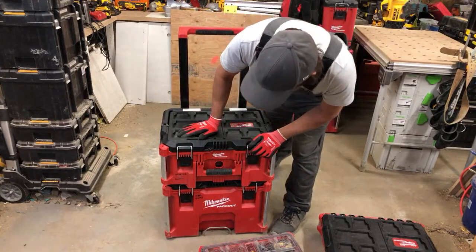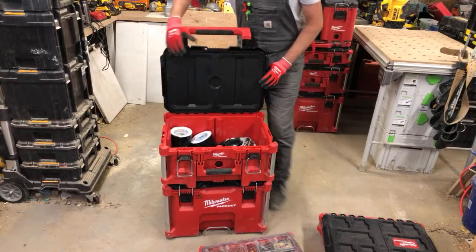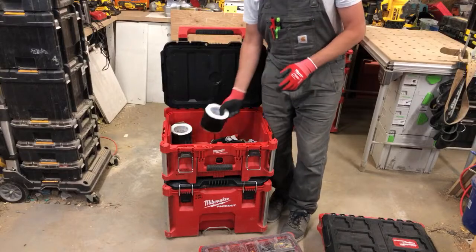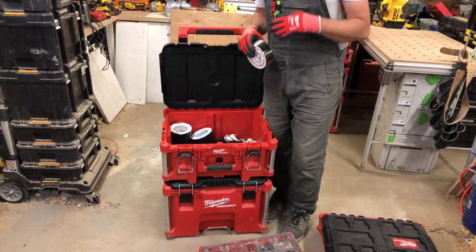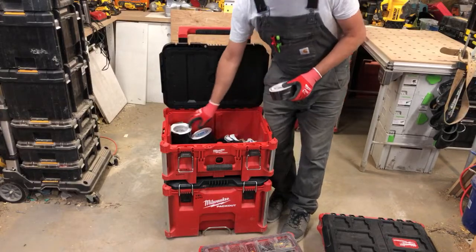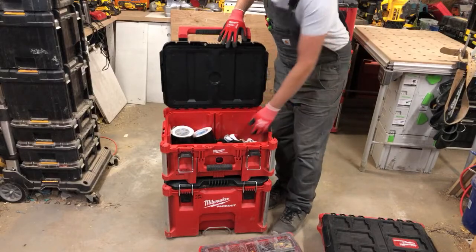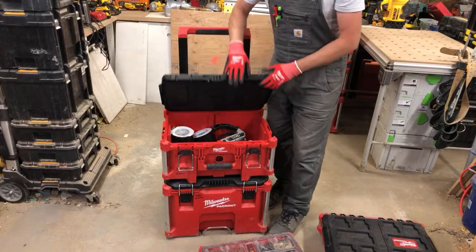The next box is my random box — this is where joist tape lives. We use G-tape on all our joists for our deck systems: four-inch, six-inch, and two-inch. This isn't code in Alberta but we go that extra mile to prolong the life of our structures. It's expensive — a small roll is about $23 and the six-inch is around $75 for 65 feet. I also keep the Camo tool, a mallet, extra blades, and my chainsaw sharpener in here.